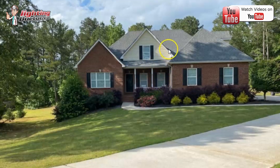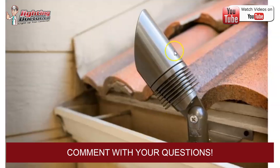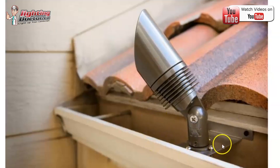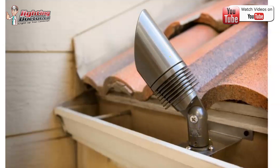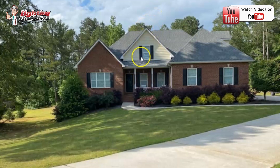Something else I would do if you're up for it is try to light this second story peak — I think it would look really good. The way we do that is just with these gutter mounts: a little bracket that fits in the gutter, you screw your light into that, and typically we'll just run the wire either up or behind the downspout, across, and mount it there. Then again, have that up light shining more upright rather than into the window — if you have it shining too low you're going to light more of the roof than the peak. You really want it shining upright just to highlight this section here.